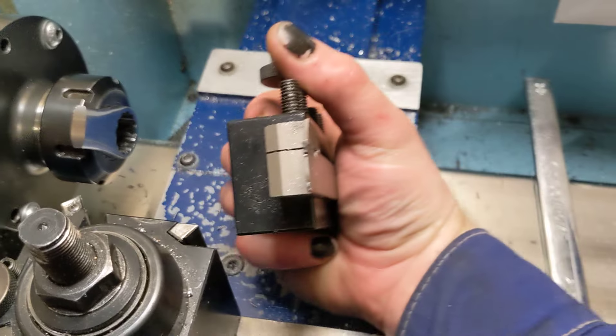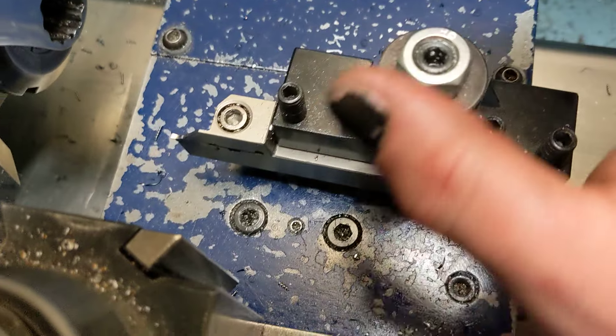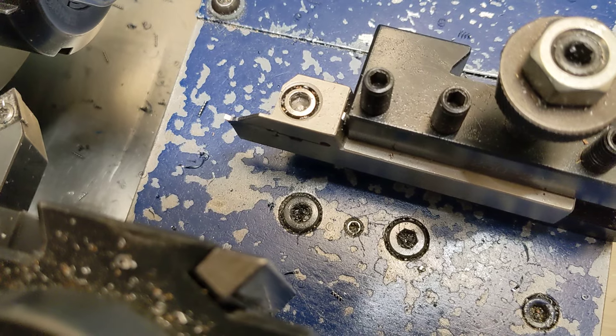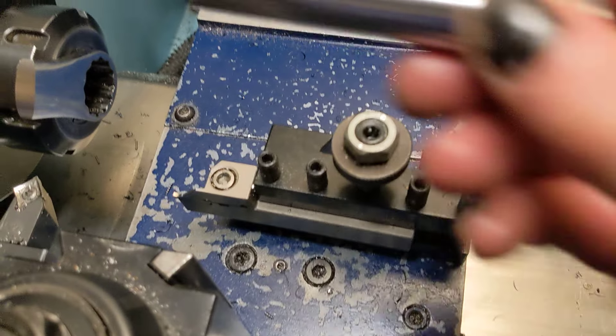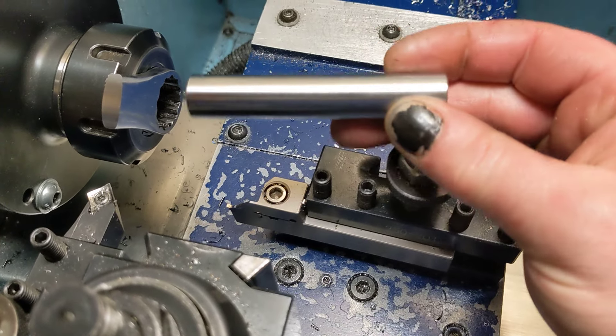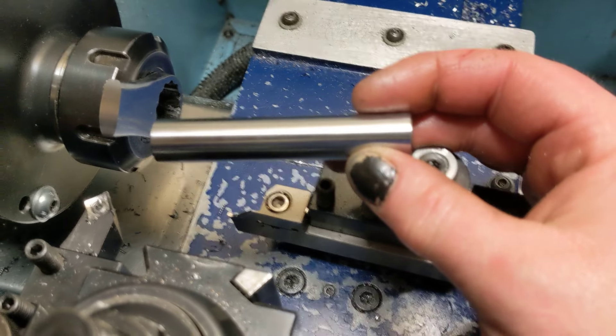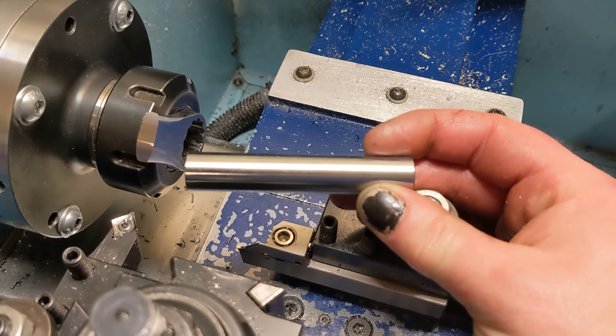This one and a half millimetre wide tungsten carbide parting blade — an insert-based parting blade meant for aluminium — recently happily parted off at 3000rpm this piece of 65 Rockwell hardened bearing shaft. I tested it. It made a fiery ribbon, but it did it.